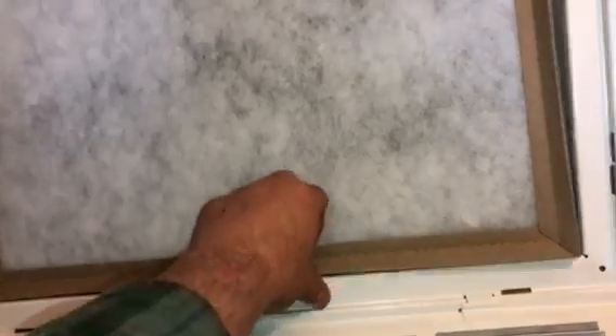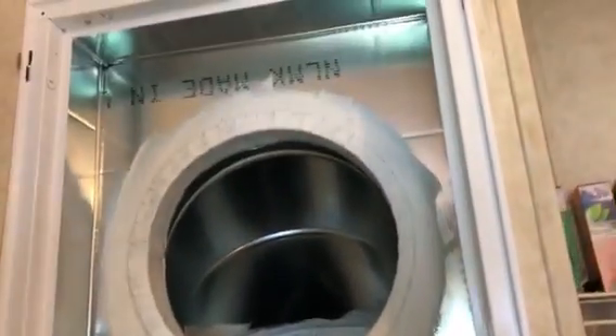So what we do is a total different approach to mobile home equipment. We take the electric furnace and all of the standard home stuff out. For the sealed sheet metal duct return, we just take a six inch deep wall box, an elbow straight out of the back of it, put a 20 by 25, then we flip the coil.